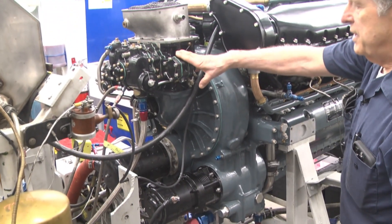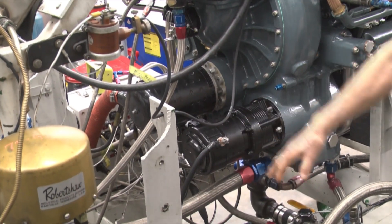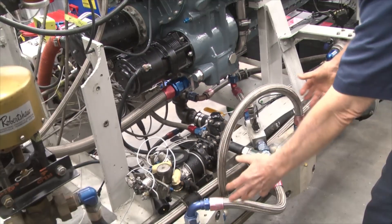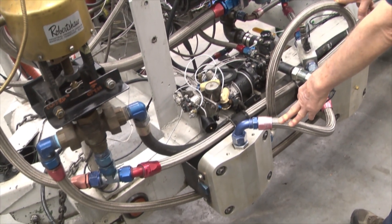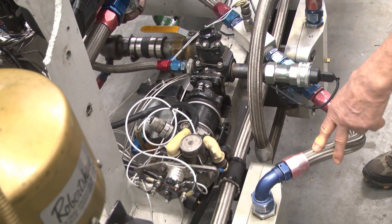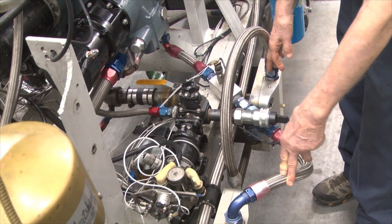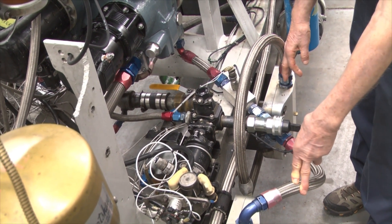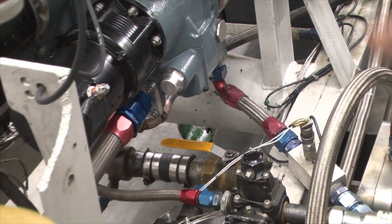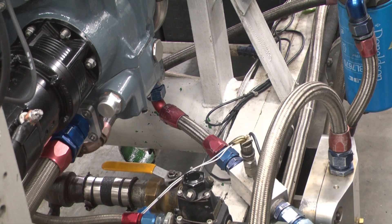This is the carburetor for the engine. Anyone familiar with an Allison engine can fast forward through the carburetor, generator, starter. These are boost pumps and solenoids to start the engine. Down here are the oil filters — filters for the oil that is being scavenged out of the engine. The engine is a dry sump engine where the oil is pumped out of the engine and sent through these fine filters. There's a filter here and another filter here, and they're instrumented so that if they sense any debris in them, they trigger lights on the instrument panel. Everything on the test stand is digital through Race Pack digital instrumentation, and analog, which is what the dashboard up there is. We also have computers that give you all the same information digitally.